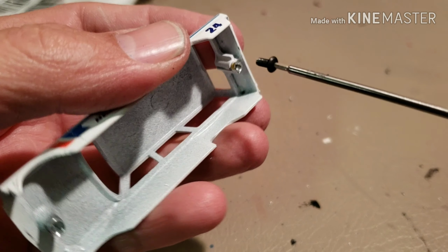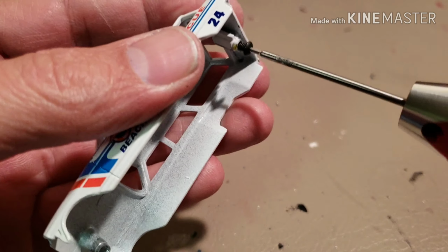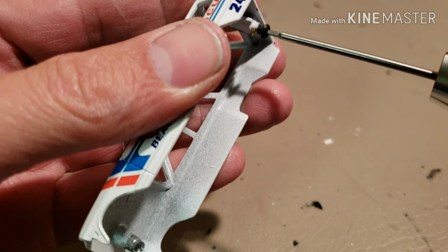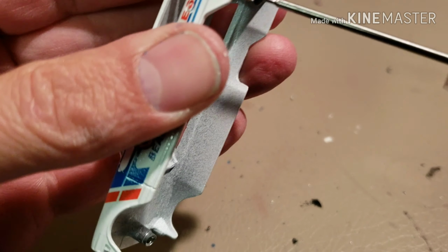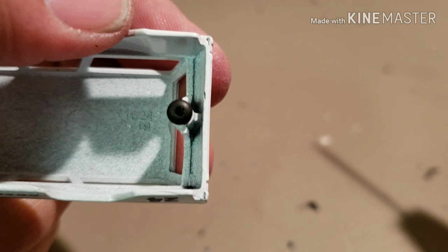Before stripping the paint, I like to make sure the screws all fit. These are self-tapping screws, so the metal in the screws is harder than the diecast, and as long as you have enough meat left in the post, there shouldn't be any problems.